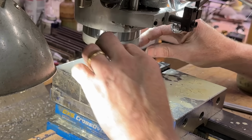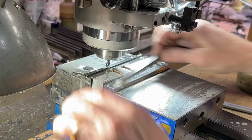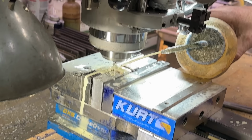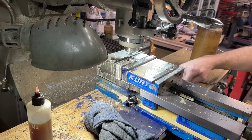Yeah, I said loose tighten. And then I put this across both of these, and that's how I know that they're square to each other, because there's only one position in which they can both be level, and that's when they're square to each other. This milling bit is centered on there, and I'm at exactly, yeah, so here we go. Now, it's a hot operation, so I keep cooling on it. Nice. Very happy with that. So that dripping sound you hear, that's my coolant pouring out of the mill into a bucket.